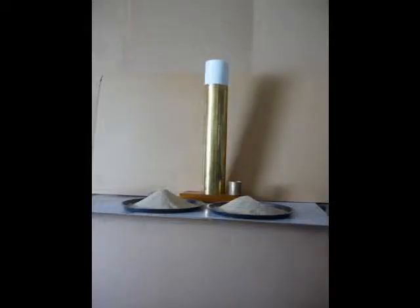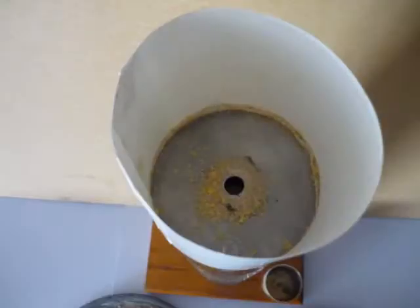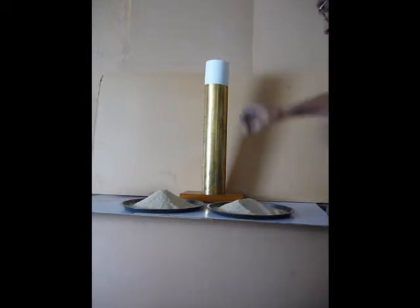The rosin sand mix weighs 1800 grams, by coincidence the same as the cylinder. The end of the 12mm arbor is 15mm inside the end cap. The thin card collar prevents spillage. The recessed arbor spreads the mix out towards the scallops in the cylinder dividers.